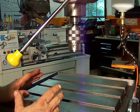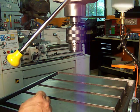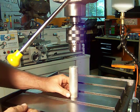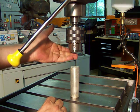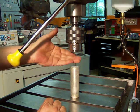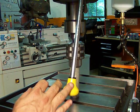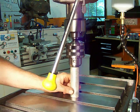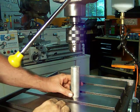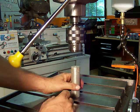Now she's semi-locked — it's not ready to drill but it's in there pretty good. To give it one little extra kick, I usually use a piece of wood but there's a piece of aluminum here. You use a softer material so you won't damage your chuck, and you never do this with your chuck jaws hanging down. You always move your chuck jaws up into the body so you hit on the face of your drill chuck. Move this down onto the softer material — aluminum, wood, or a hard piece of plastic — and give it two or three good jabs. You're forcing these two tapers together, which forms a locking device.